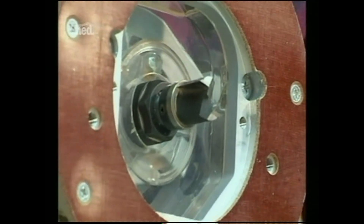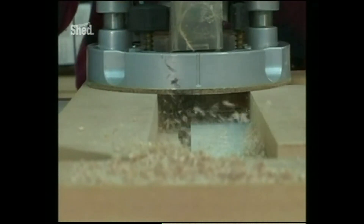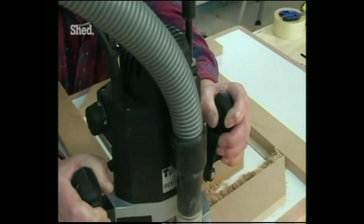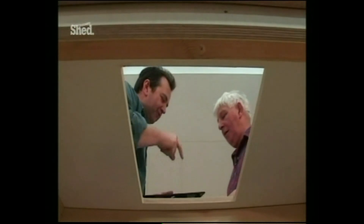What I've got in there now is a three-quarter inch diameter cutter with a bearing on it, and that's going to cut a recess to whatever depth we set it. We need to make it three-sixteenths of an inch deep. Okay, Ron — I've got the router lift.